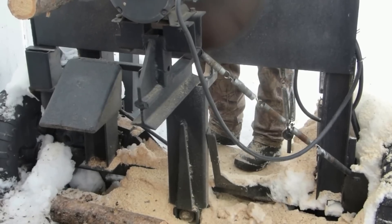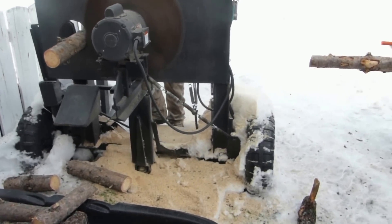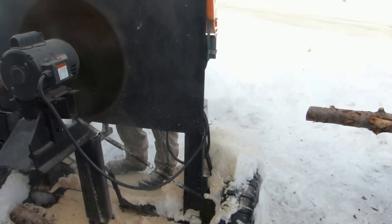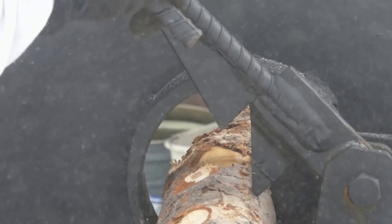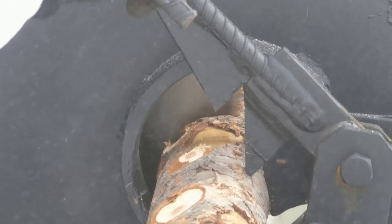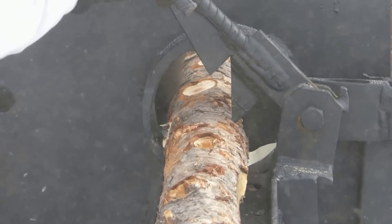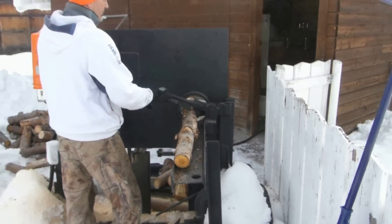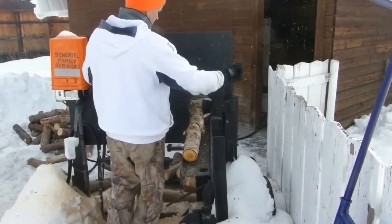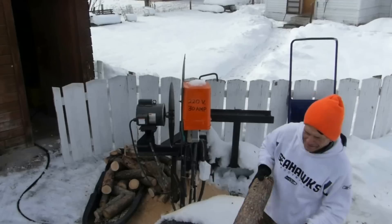This is not a carbide blade. It's just a 24-inch steel — what they used to call a buzzsaw blade. It's almost maintenance-free. There's really nothing except sharpening, and you wouldn't have to do that yourself. You could take the blade off and take it to a sharpening shop, the same kind of places that sharpen table saw blades. That's really the only maintenance involved.